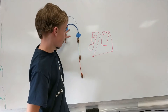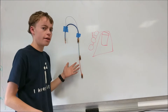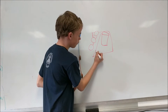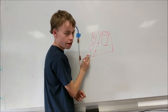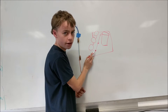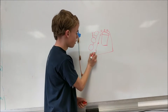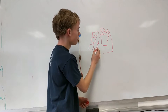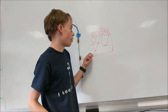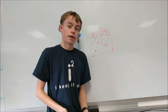I designed this circuit that lets me know exactly where inside the tube each ball is. It uses infrared receivers and transmitters to sense where a ball is. Each sensor is placed inside the tube, and if the ball goes inside, the infrared sensor activates a light bulb on top. There are three light bulbs — one for each infrared sensor — so this is how it helps us tell where the ball is inside the robot so we can compete and score very well.